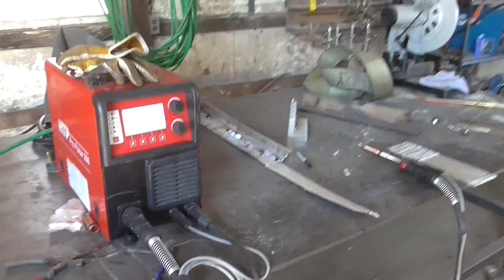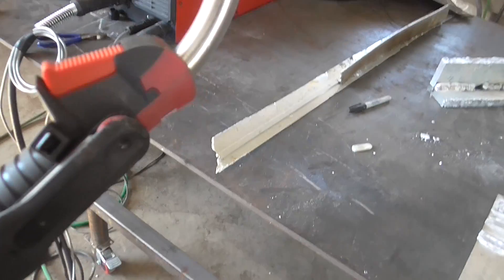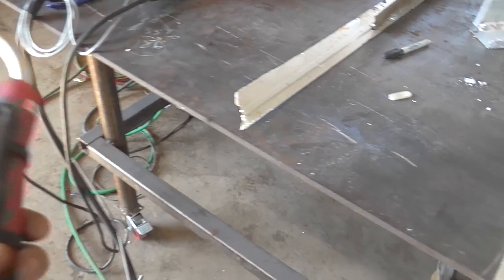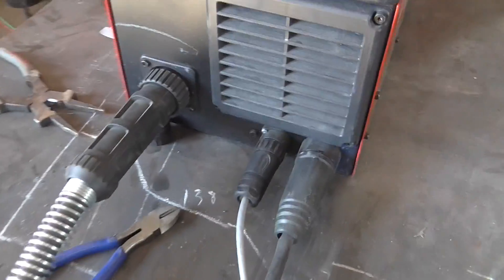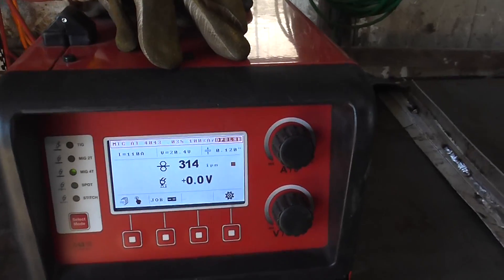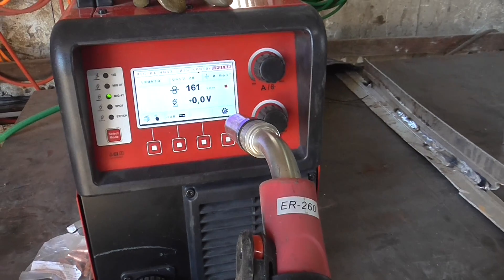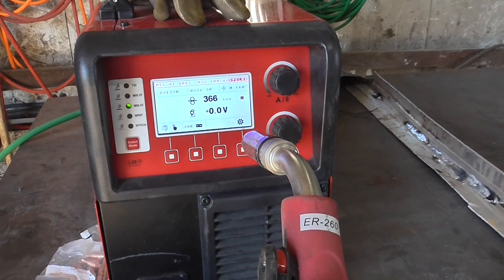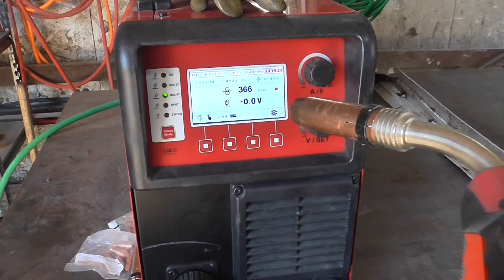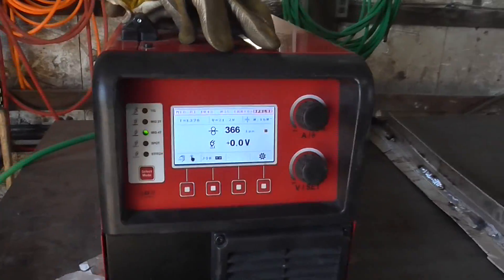We're over here in Jeremy's shop, and I found this Pro Pulse. The interesting part is this looks like there's a TIG remote taped to the gun. It goes into this receptacle here, and there's a little R flashing for remote control. Apparently you can use the slider here to adjust your synergic settings while you're welding aluminum, so you can make your own hot start, your own crater fill, totally independent of any settings. I thought this was pretty cool, so I need to try this out.